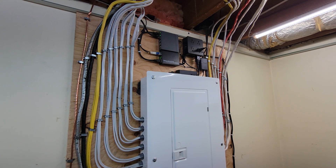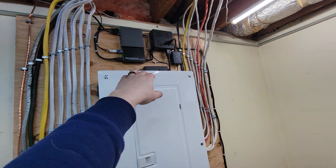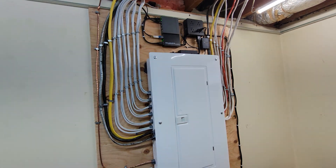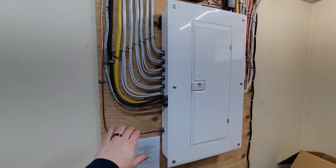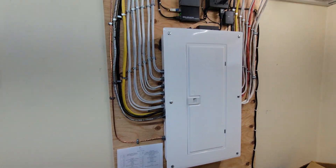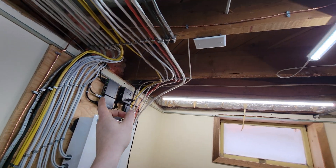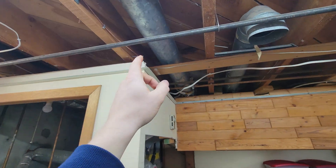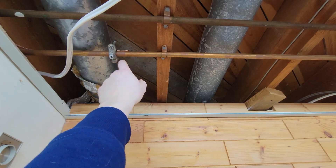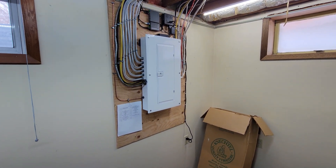I put power bricks on both ends just to provide power for the networking equipment. I installed a piece of plywood on this side — same as in the garage — just to mount the panels to. For grounding the sub-panel, code here required going up to the water shutoff, but they ran it to one of the hard copper lines and clamped it there.